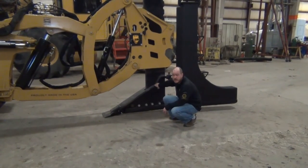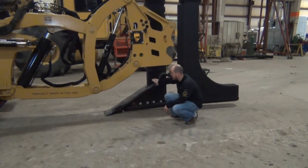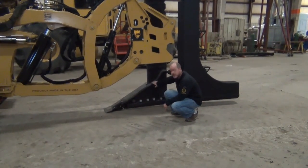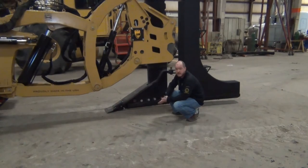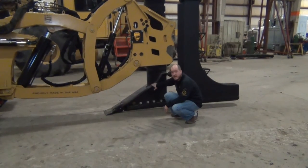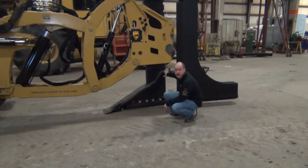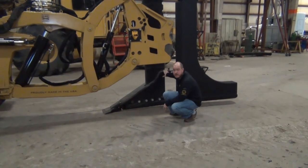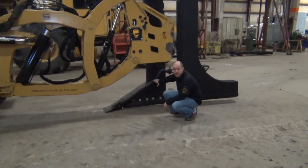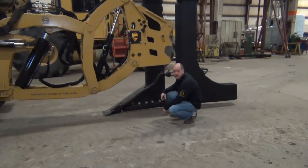It's a feature you don't get on some of the competition and some of the other budget plows out there. Mold board angling — I get asked about this a lot. As you can see, we start this at a fairly moderate angle, we get that dirt out of the way, we get that cut made, we get it moving. Then we really ramp it up and get it after it's already loose and moved out of the way. This makes our plow pull a lot easier compared to most of them out there — it's a little bit more refined approach on how we look at that dirt.